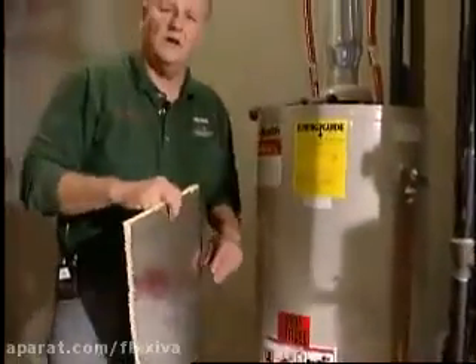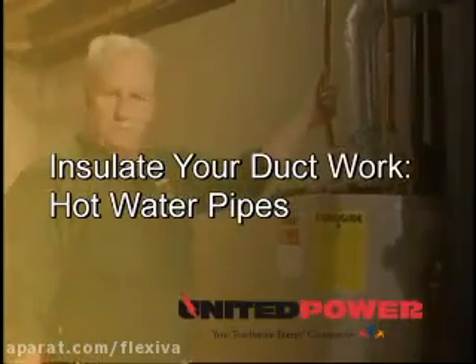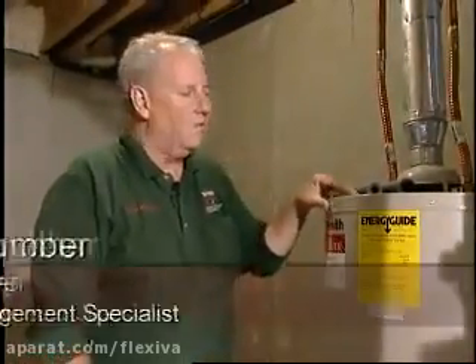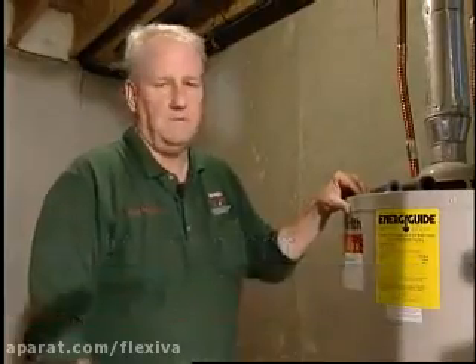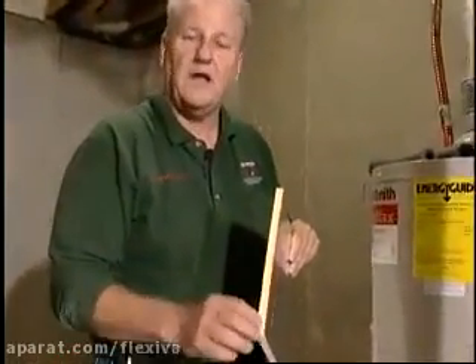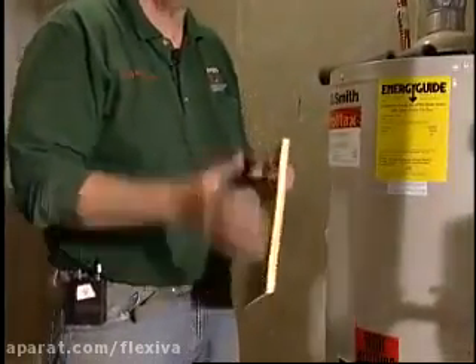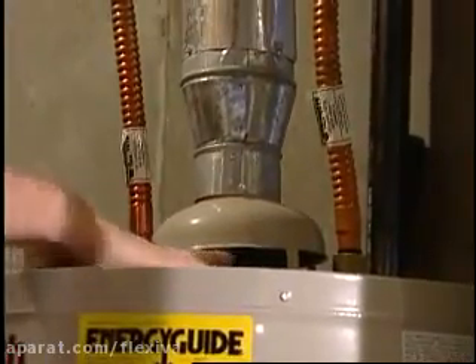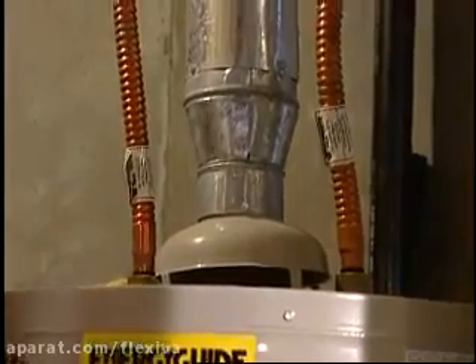The last project I want to look at is Heidi's water heater system for producing domestic hot water. People ask me all the time whether we should have a water heater blanket. Years ago water heaters were insulated with fiberglass, but no longer — they're insulated with foam about two inches thick, which is much better insulation. So why would we put a jacket on when all the heat loss is coming out through the center flue and the bottom where the burner is?